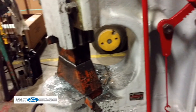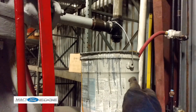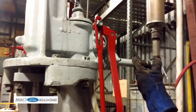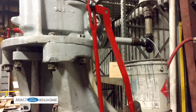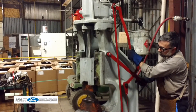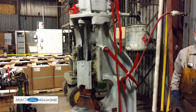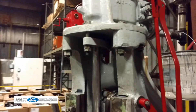Basically, what increases the impact is if the air valve is totally open. That's your touch can for your oil? Yeah, for right at the moment. Now this is the main air valve — this is your throttle. So I can drive it like this too, I can crack this valve. And I can just roll like... you know? So I can do single blows if somebody else is holding the piece and I just need to do kind of like a stamping operation.